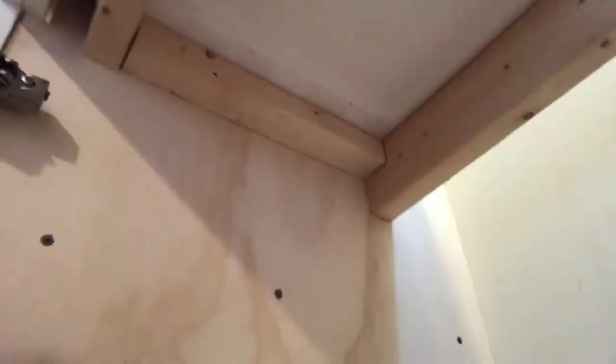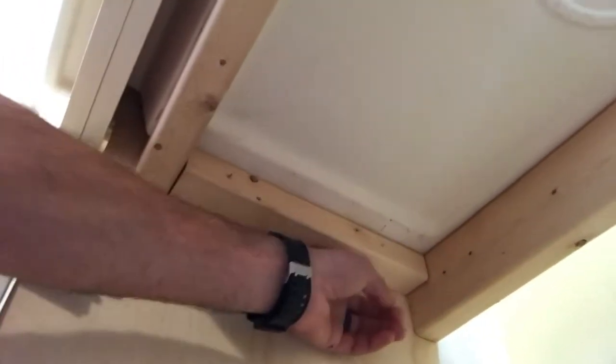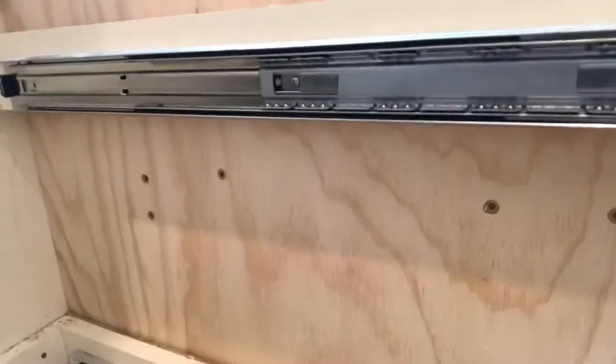Here's the biggest thing — our braces. We put a two by four brace back here and used two by two. We pretty much cut a two by four in half and braced it up there, screwed everything together, and came in from the outside and screwed in. You can see right in here those screw holes — that's holding everything nice and neat.